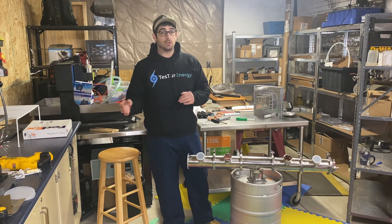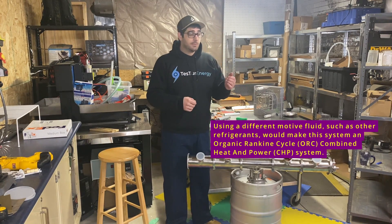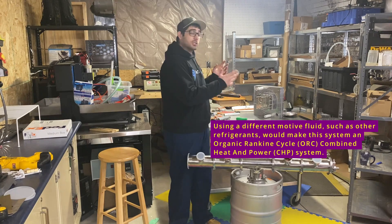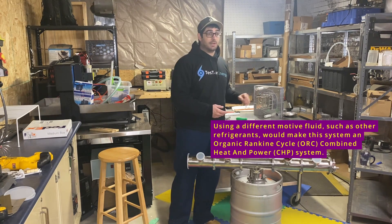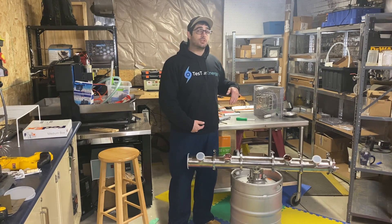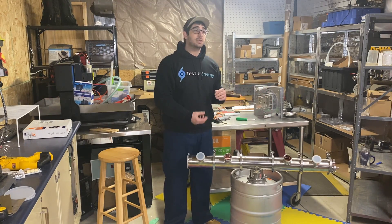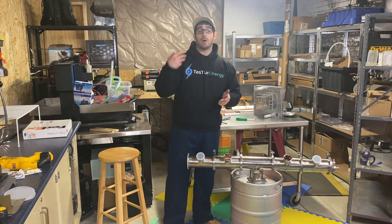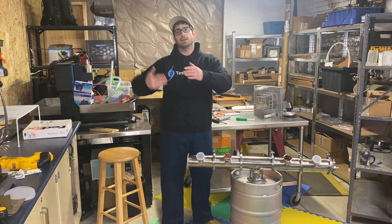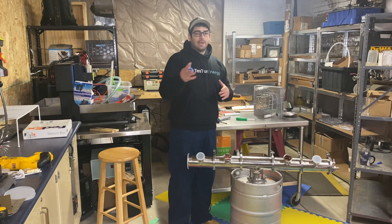For the turbine in the cryophorus — vacuum steam or cold steam — you want a motive fluid with the lowest latent heat of vaporization, because that latent vaporization energy is not directly usable for the expansion through the turbine. That said, you can use heat exchangers for boiler feed water preheating, which extracts some of that energy to heat water returning to the boiler. It's not an infinite loop, just a recoup to raise overall system efficiency.